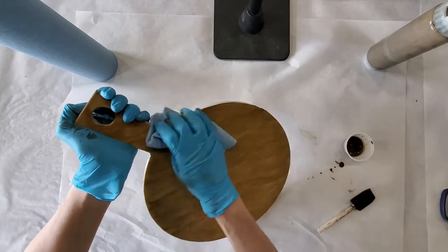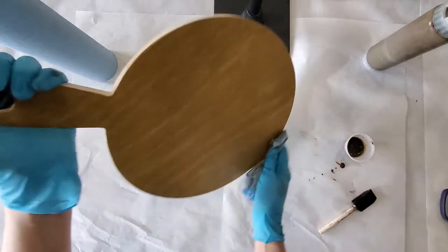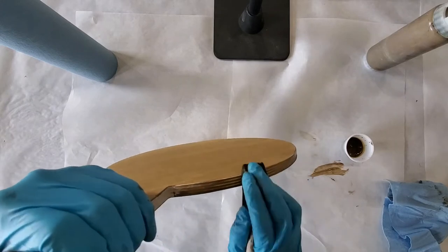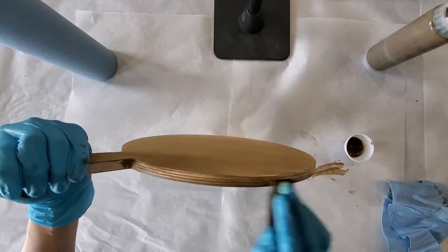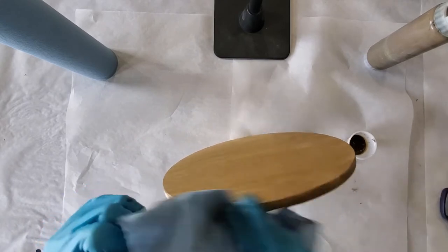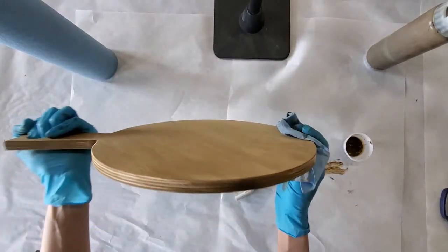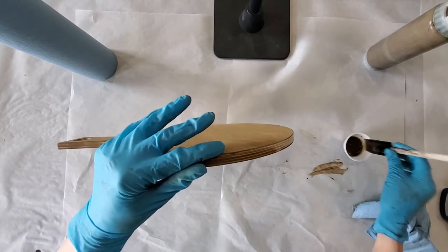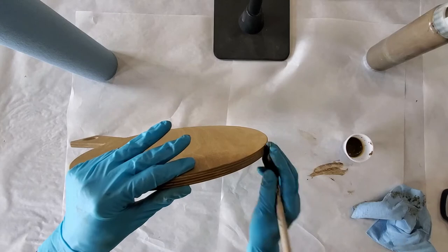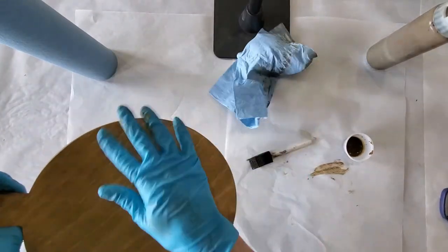The front is done. I'm just going to wipe that side off and then I'm not really going to put on any extra stain — I'm just going to gently press what I have in here and wipe as I go. As I'm wiping I'm overlapping on the back side so it helps wipe away anything extra. When I do get some stain on my brush I'm just dipping very lightly; I don't want a whole bunch dripping on either side.